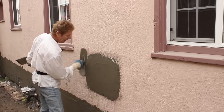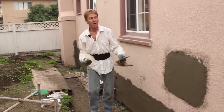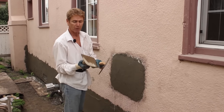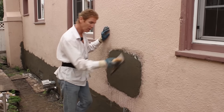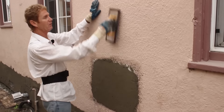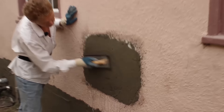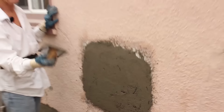So we got it right where we want it. Now, if I were to use a hard rubber float or a cork float or a plastic float — this is actually designed to bring out a worm finish, you put sand in it and it makes worm finishes. Cork floats are kind of useless, I don't like them. A hard rubber float compacts the stucco. If I do this, it's going to drag everywhere. Watch — when I start floating with a hard rubber float it's going to drag on the painted surface and it's not going to match. You see that? See them holes? It's creating holes — that's not the finish we want because this is designed for a different purpose.